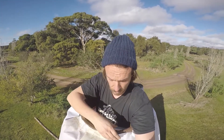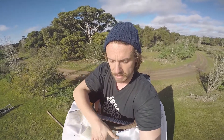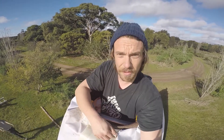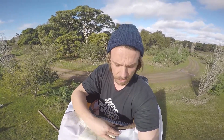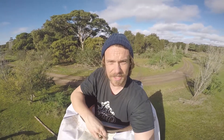Check us out — we're up at the bloody top of a teepee! This has worked out really, really well. There's always a little bit of anxiety that the measurements aren't going to be bang on, but this has worked out really well. I'm going to fold this easily and probably duct tape it first, then make a nice flashing that will cover this. If I left it like this, it would be a big pool area for water and that would probably get through the seam eventually, or come through where it meets the steel. The hardest part is always between two dissimilar materials — the billboard is pretty dissimilar to the steel, so making sure that's really watertight is very important. It's amazing how strong the ten-sided decagon pyramid is — really, really sturdy. We bolted it on, there are bolts going through here, really, really tight.